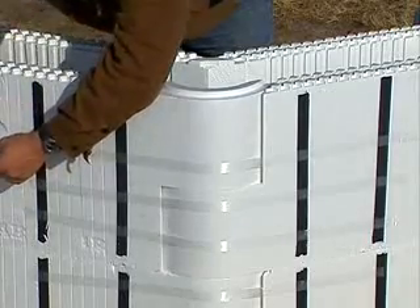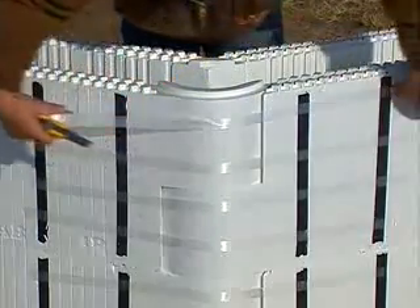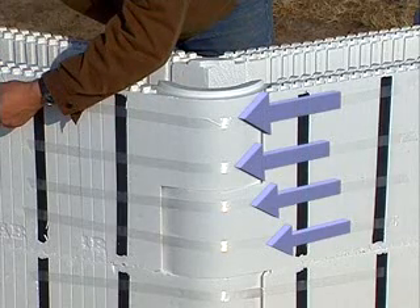The form needs outside support to cope with the internal pressure that will be generated during concrete placement. Use fiberglass tape to reinforce the corner in the four locations shown here.